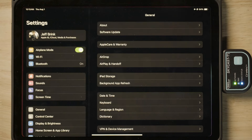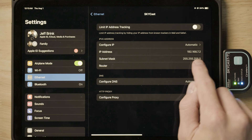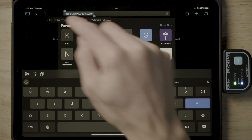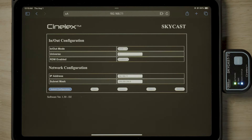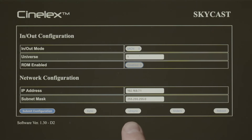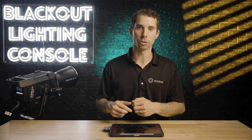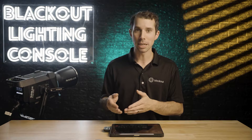If you want to customize it, you go to network settings, ethernet, SkyCast, and go to the router address or the IP of the device, which is one below what your iPad is. Type that in a browser and now you can switch this from ArtNet to sACN and whatever universe offset you want to give it. Plus it allows RDM data to pass through it. Want to link a fixture? It's the same procedure as always — make sure your lights are unlinked and then short press the sync button. A little blinky blinky and done.